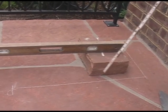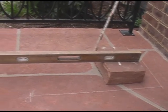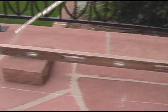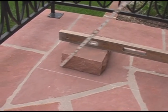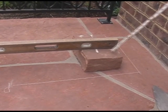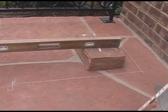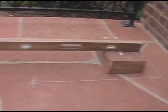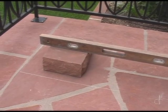Okay. And as you can see, you have the 8 inches facing you, the 10 inches going back for the support. Now you can vary this. If you want to, we're sitting 4 inches in. You can go 5 inches in or even 6 if you feel like these are spread out too far. Depending on what the viewer wants to do. Aesthetics. Exactly. And the length of the top piece determines also where these should sit. But you get a good feel by laying it out with a pencil.